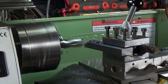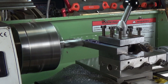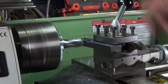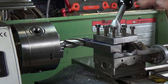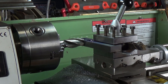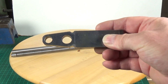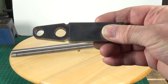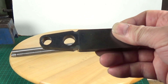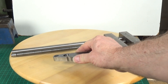Just got one more pass. There you go — very simple: clamped in the tool post, set the compound slide to the angle you want to take the material off, and that'll make a damn good job of it. I've finished working on the spacer on the lathe and you can see the finished results — it's done a really nice job of removing the excess metal off the sides. I've started to shape the end on the belt sander, and now we need to cut it off across here and then do the final shaping, which will be done on the belt sander.